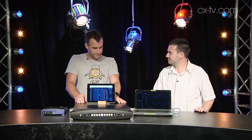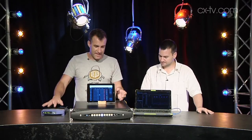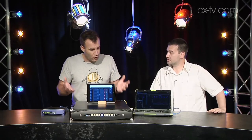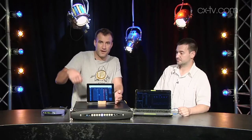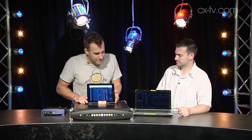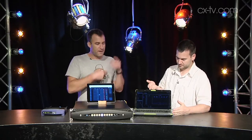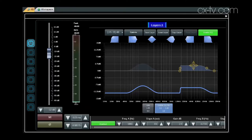On the topic of brains — I've got a wireless router, a laptop, and an iPad all sitting here, these are all things that can talk to the X4 and indeed the X8. For monitoring purposes you've got this little iPad app; you can push the button on the front and enable a wireless network straight within the device and connect to that with your iPad. If you want to go in and do configuration things like adjusting crossovers, filters, EQ, delay and so on, you use a laptop, download the Armonia software from the PowerSoft website, link in via a single CAT5 and you've got full control over the amplifier.